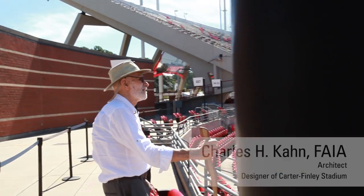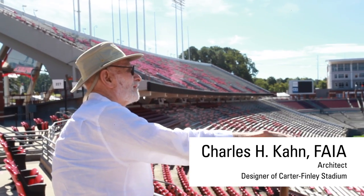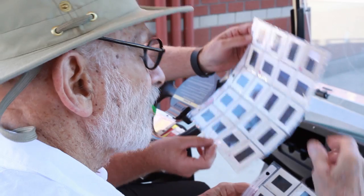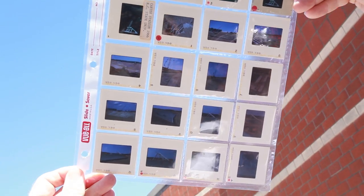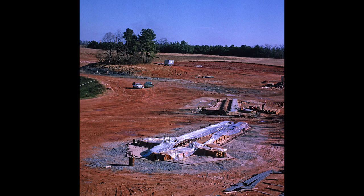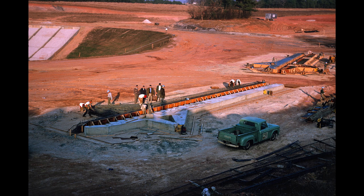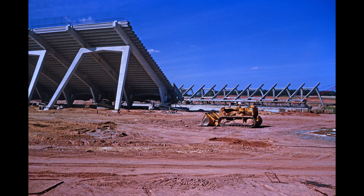The concept I had was this — it's a little difficult to explain here, but if you look at these, the stadium would be built of three pieces of precast concrete, all of which could be precast over a period of time. They'd be erected as a Tinkertoy set, and anything else that had to be done to the stadium did not involve adding anything, but only subtracting things, so that it was easier to build that way.